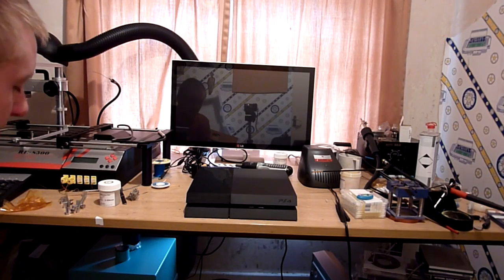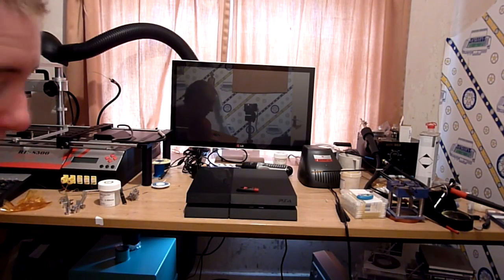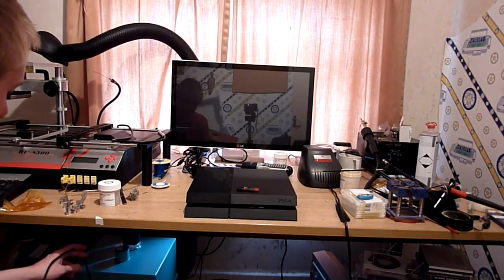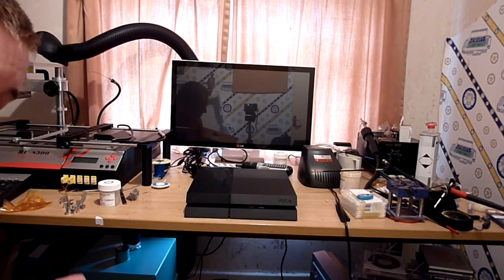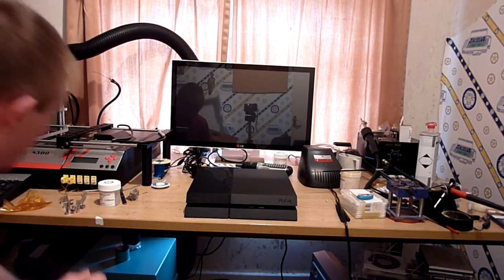You're best off downloading the full system software, so the 700 or 800 meg version, as opposed to the cumulative update, which is about 200 or 300 meg. Both are available for free from PlayStation.com. At the time of this video, we're on software version 2.57, so that is what's on this stick. So I've got that ready just in case we need it. But hopefully this is going to go into the system software and we can call this fixed.